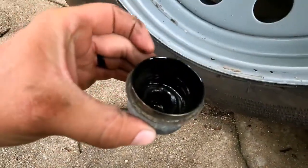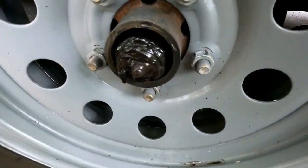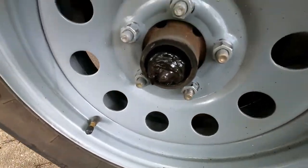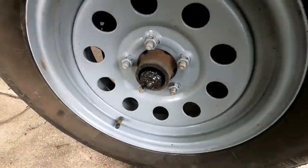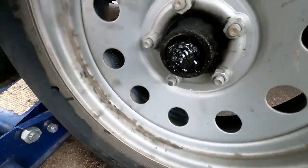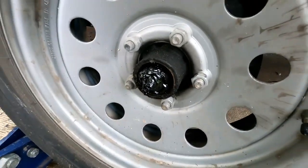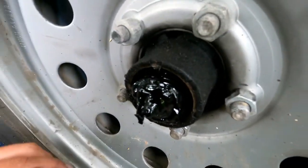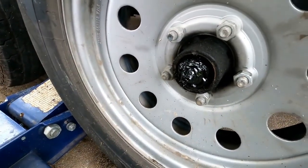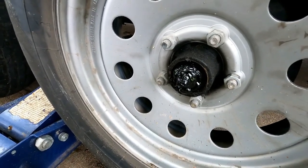Well, that is nasty. I think I've greased these once in the last two years of ownership. The bearing sounds okay — there's a little bit of play to it, might have some padding to it, but it doesn't seem like anything's out of adjustment. This one's the worst; this is the one that was leaking. Like I said, I think this grease has just liquefied. So we're going to go ahead and grease these up with new grease, cycle that through, and hopefully get these back in serviceable condition.